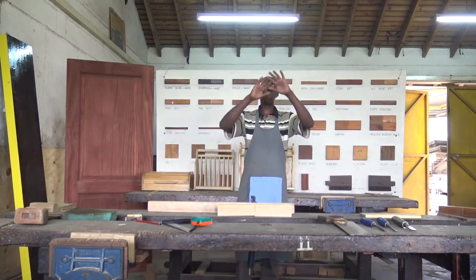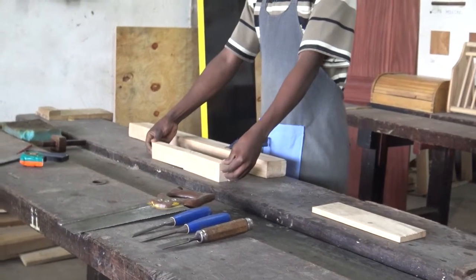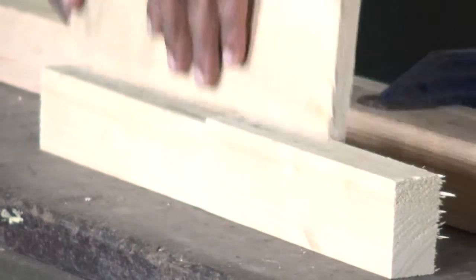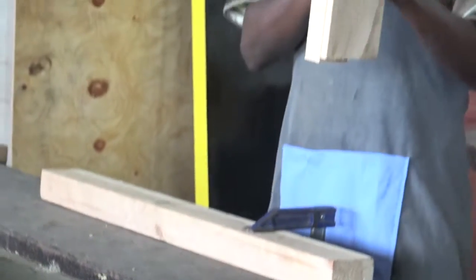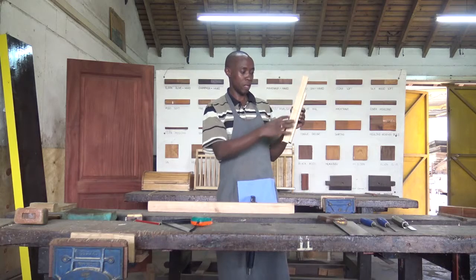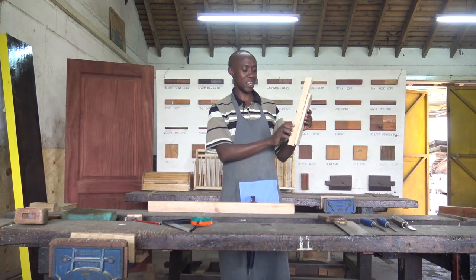So we have the roof work, which falls under carpentry. If we are using the butt joint as a lengthening joint for roof work, then we may be required to use a cleat. A cleat will be just another piece of timber that we're going to use and nail. Nail it to this one, nail it as well to this one, so that it provides some continuity between the two pieces, and then the butt joint is well strengthened in that way.